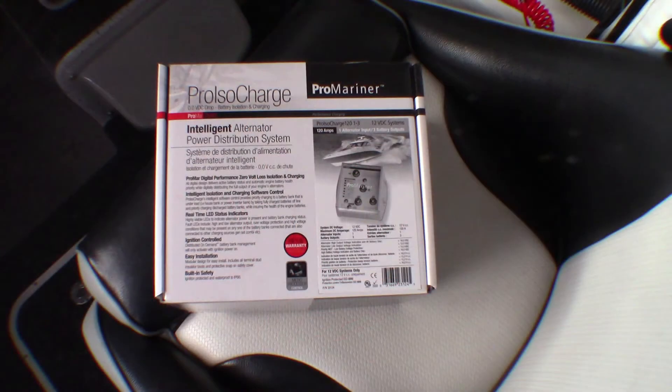This is my battery isolator. It's automatic. I have always had trouble with manual switching. The idea of the manual battery isolator is that you turn the switch to save one, which is your engine battery, and start your engine. Then you turn it to both while you're running so it charges both batteries. Then you turn it to two when you stop, so you're using your house battery. Then you turn it back to one to start your engine, then back to both while you're running, then you turn it off when you get back to the ramp. 99 times out of 100 I forget one of those changes.